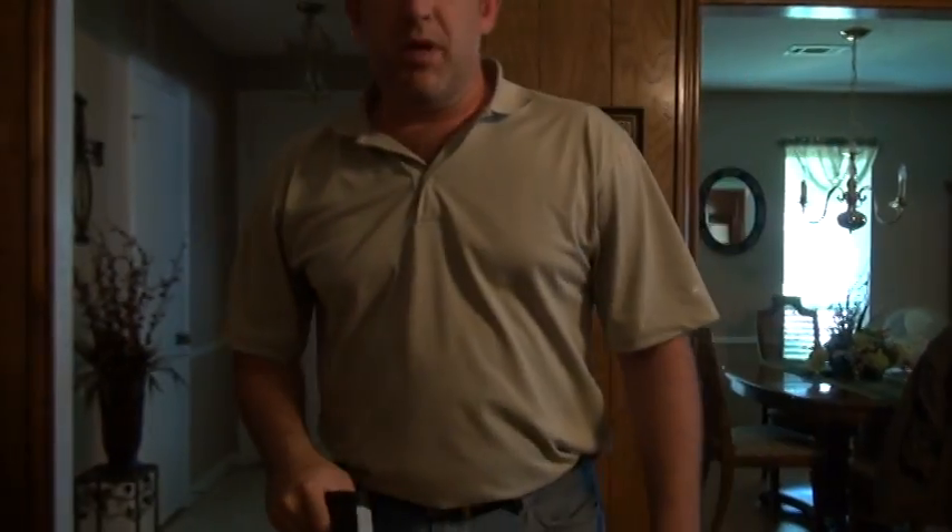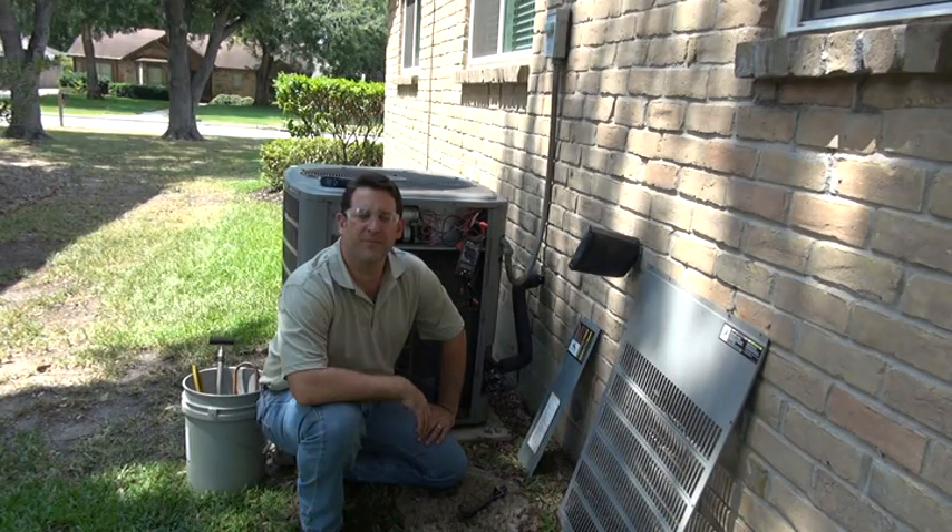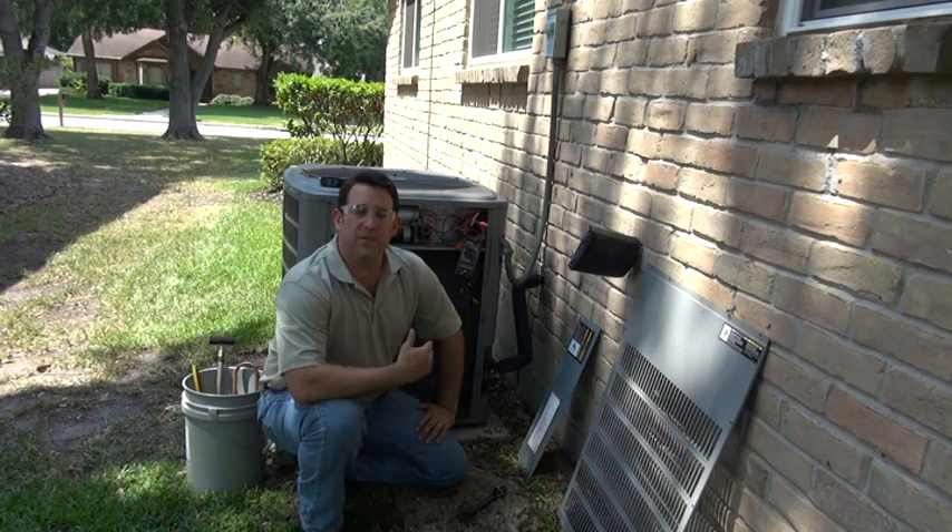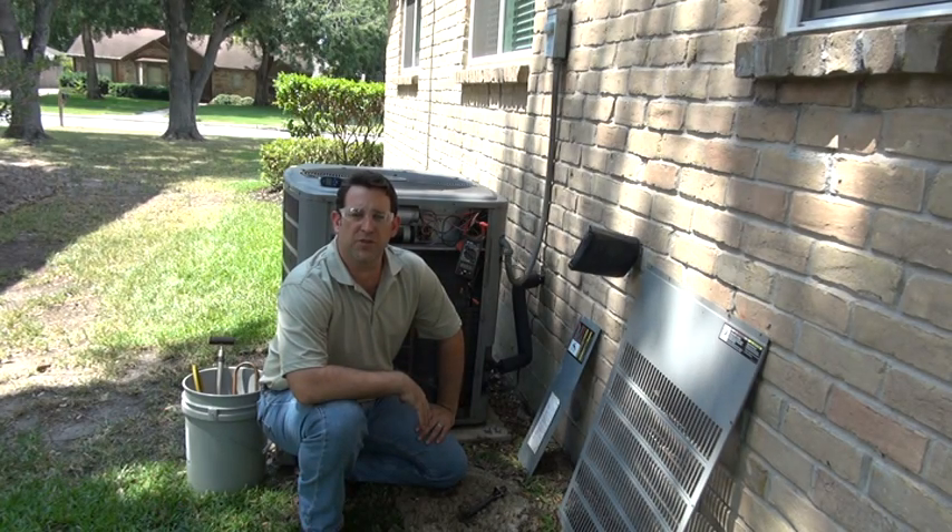So we've got a little bit of a delta T difference right now. What I want to do is go outside to the unit and inject the Frigitek so we can get this thing to become energy efficient and also assist on some of the preventative maintenance issues that have been going on. Now we've moved outside. This is our four-ton R22 system that is about eight years old.